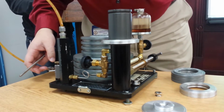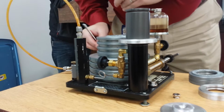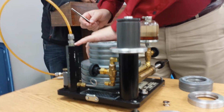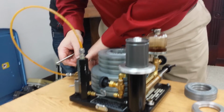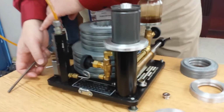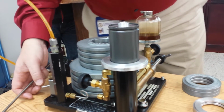Ooh, that's not going to work. Wrong one. I wanted a WG230, which is going to be 1 PSI. So there's the 230. There's 1 PSI. Now I need 4 PSI more. Well, in this case, I can use a 233, which is 5 PSI.